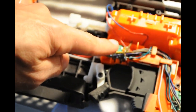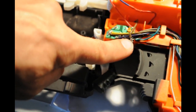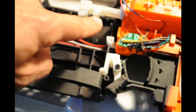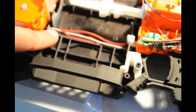And so I tacked that one in, and then I took the LED negative along that wire way behind the trigger mechanism and around the top and tacked that into the negative pad lead of the board right there. So that should do what I want it to do. We get the full circuit feed, and then when that button is tapped, we get that muzzle flash out here and in the jam door area when it's being fired.